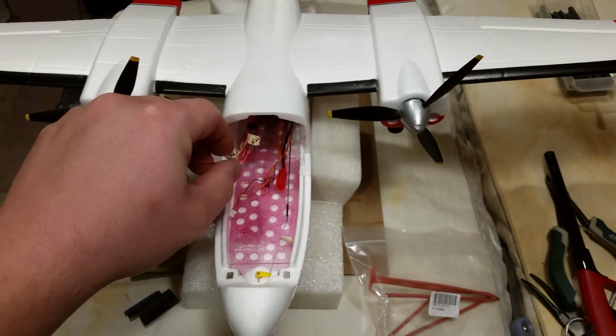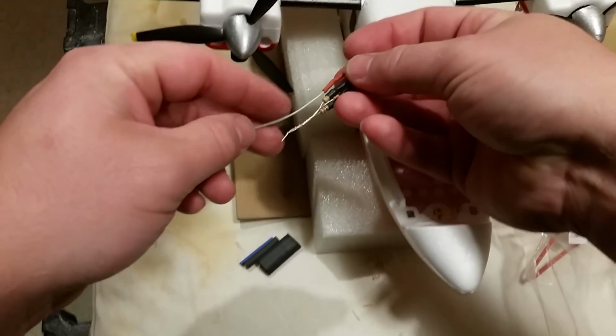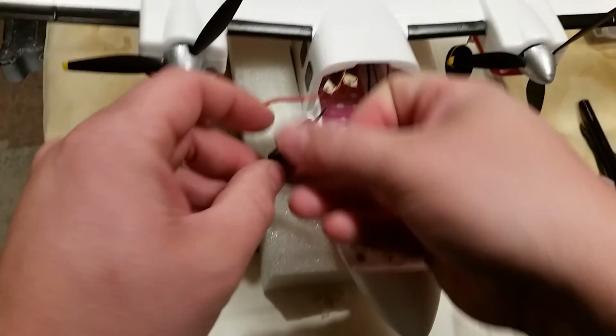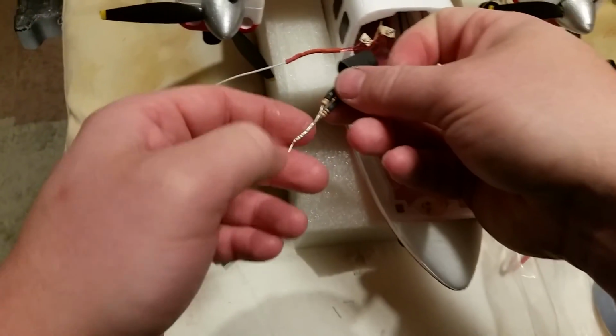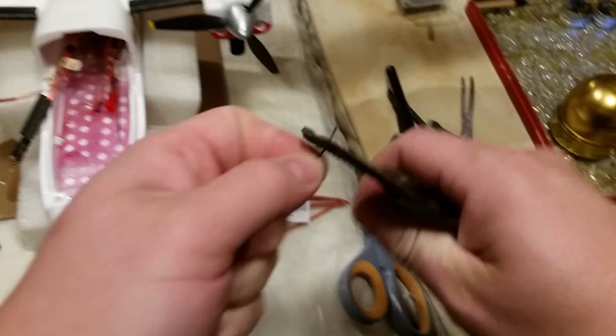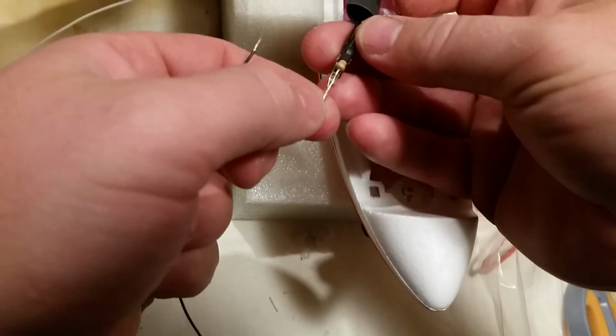Okay, so that's good there. And then our negative side, we gotta go ahead and feed on our heat shrink now. It's just gonna go over the bundle of resistors when we're done. And then for the moment, we will take our negative wire, which is gonna be just whatever we need of this. We shouldn't need that whole length, of course. Strip back a pretty good amount, and we can feed on the other sizes when we're done.